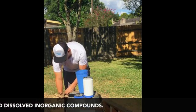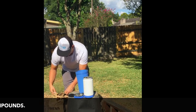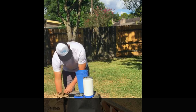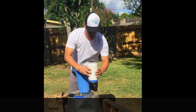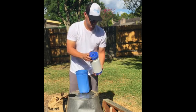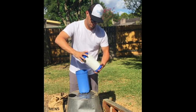One thing to note is that this carbon filter is not effective in removing minerals, salts, and dissolved inorganic compounds. One common question I receive is how often should I change out the carbon in my carbon cartridge? The simple answer is: if you notice any changes in your water, it's probably ready to change. So if you got the carbon for odor and that odor returns, it's time to check your filters. Otherwise, I change this carbon once a month regardless.